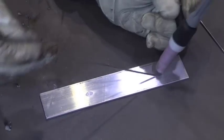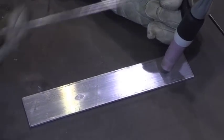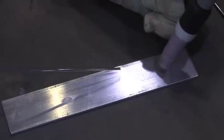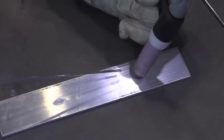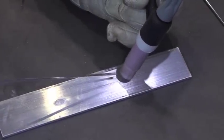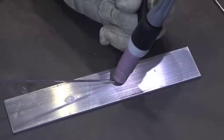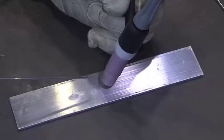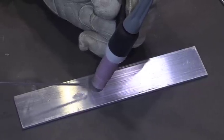It's usually in a 90-degree configuration to the TIG torch. Your TIG torch is slightly angled in a forward push motion — never drag a torch, always push it — and you're introducing the filler metal in front of it, right on the leading edge of the puddle. So we're just going to practice that. Notice one hand is being smooth and steady while the other hand is actually dabbing the filler metal.